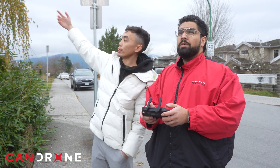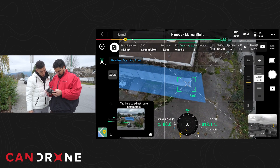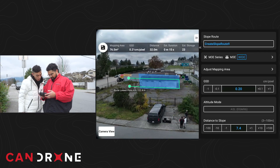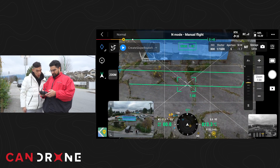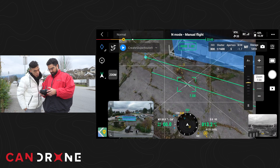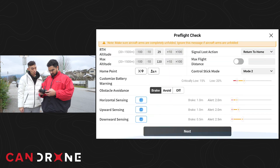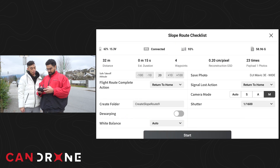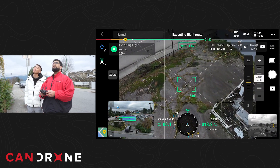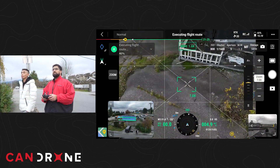There are power lines over this side, so fly over to check that surface. The bottom portion is slightly outside of the building, so adjust that and drag the corners. We have 0.2 GSD. Do you see any obstructions within the area that we should be concerned about? The biggest thing is probably just some trees down there. We'll watch out for that while flying. Hit the play button, accept everything, and hit start. We just monitor it and it's going to go sideways, then lower to altitude.